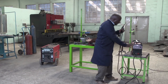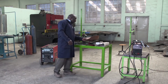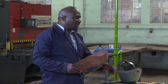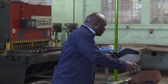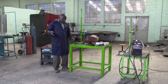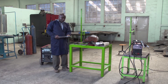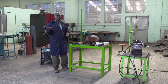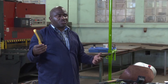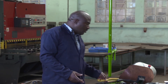Now we have connected our cables. Apart from the welding machine, we have some accessories. This is called the hand shield — it is used to protect our eyes from the rays we get when striking the arc. Also, we have the helmet, which we can wear on the head. We have the tongs, used to hold hot metal — we do not use our hands to hold hot metal. We have the chipping hammer, used to remove the slag after welding. Also, we have the wire brush, used before, during, or after welding for cleaning the base metal or the weldment.